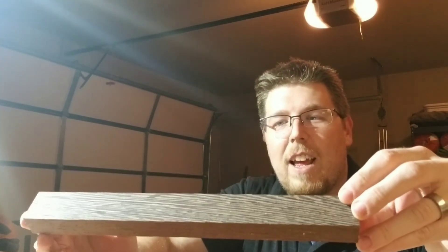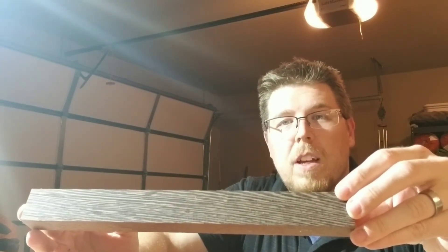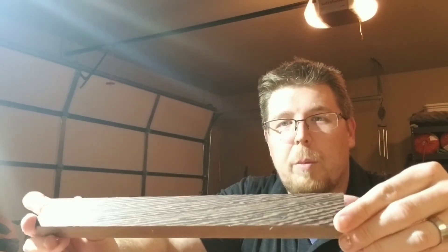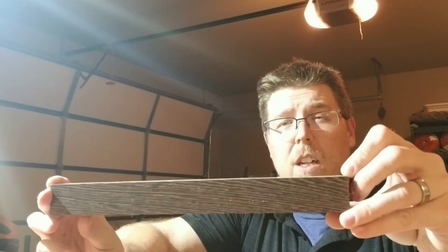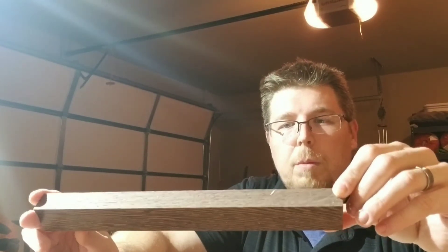Next is wenge. This is a very small piece I have, but you can see those natural light brown streaks against the black stripes running through it — that is how this tree naturally grows. If you look on the edge, the grain pattern is continuous all the way through the board, so no matter which side you're looking at you can see those distinct ridges. It does have a tendency to split along those ridges, so it can be a rather unstable wood. I wouldn't suggest it for anything like a cutting board, as over time it could become porous and harbor bacteria.